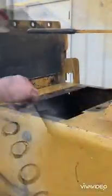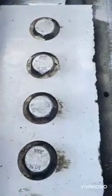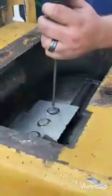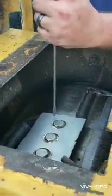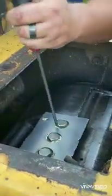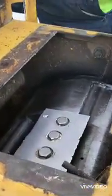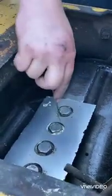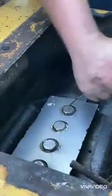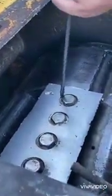If you point your camera down there on the bolts, you see all the debris, the wood and stuff that's wedged down in there. You got to clean that out, or you're not going to get your socket on the bolt. I just use a flathead screwdriver and a hammer, and just start prying it out. And once I get it all loose, I use a pick. It comes out pretty easy. It's just a little time consuming, but it's a must, or you'll never get the socket down inside the hole and sit on the bolt, and you'll just strip it, and then you got real big problems.